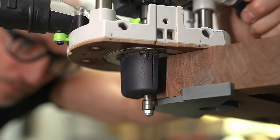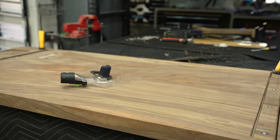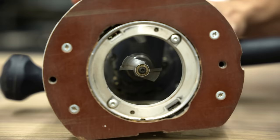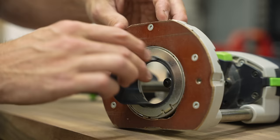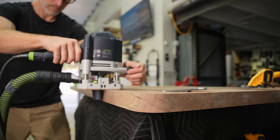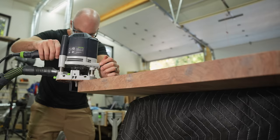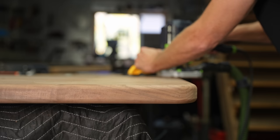I generally gravitate towards really sharp edges — sharp angles, sharp 90-degree corners, 22-degree chamfers — but this one was already different with that patchwork, so I wanted to keep with the unique theme. Maybe I subconsciously got this from the gals at COC Design because they do a lot of soft edges as well with their patchwork inlay. I used a two-and-a-half-inch radius on the corners, then came back with a half-inch roundover bit. This is going to give very soft edges all around — a unique look. I'd love to know what you think, whether it clashes or goes with those square patches.